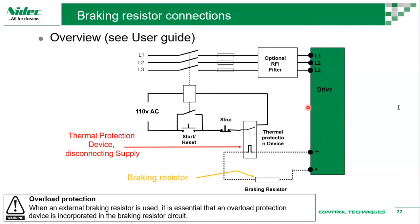Okay. It depends on the standards. I've been approached by a few customers who say I need to have this specific standard. But if you look at the standard, it will have a scope. I forgot the particular standard, but there was one that talks about switchgear having to comply with a specific application. The scope itself talks about constant speed applications. So once you change the speed, the scope will have an exclusion saying that it does not apply for electronic controllers which have the capacity to vary the speed.